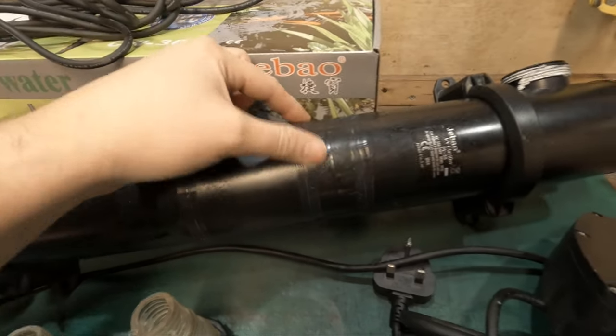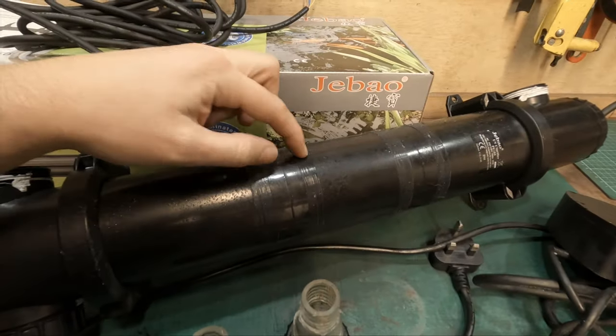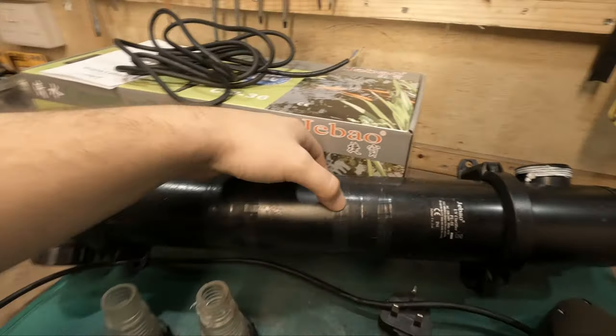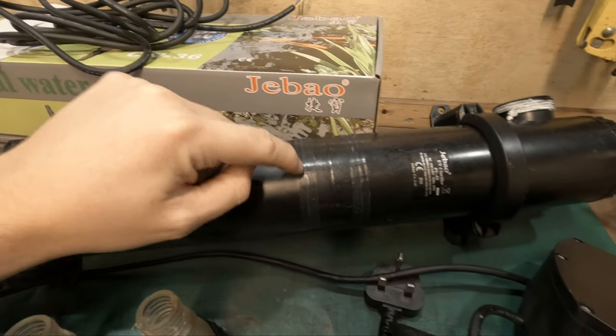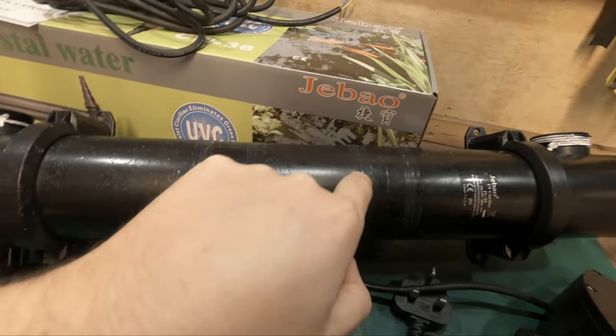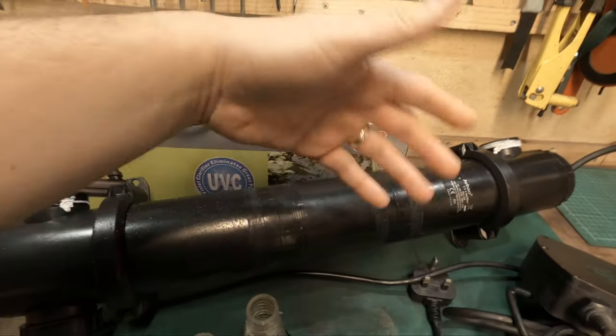I taped off to make it look a bit neater than it actually should look. But basically, I taped it off and put a thick layer of sealant on all these joints because these started leaking water. That has actually held up over the years, but as you guys seen in the footage, it was starting to leak light through. If light's coming through, it's just a matter of time before this starts leaking because light never used to come through. So that just shows me that from the inside, it's starting to wear out.